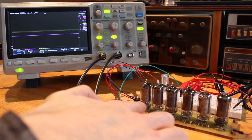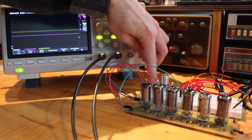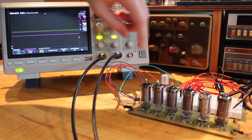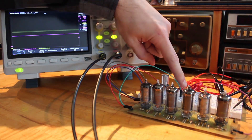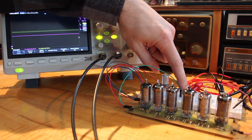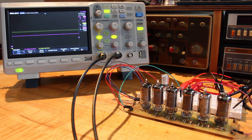Let's pull the breadboard out and hook up our circuit board and give it a test. I've got my operational amplifier set up with jumper wires plugging into the breadboard so we can set up the feedback path. Right now I've got a 10,000 ohm resistor for the input and a 22,000 ohm resistor for our feedback resistor — that should give us a multiplication factor of 2.2. With the old version, we didn't see a correct multiplication factor, so hopefully this time it's more accurate.